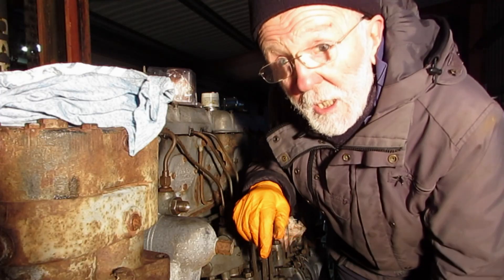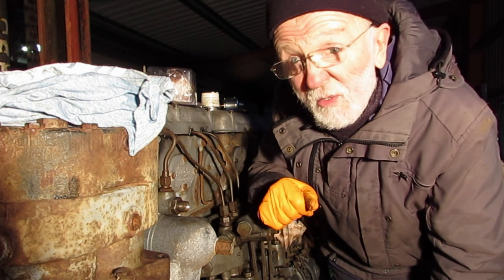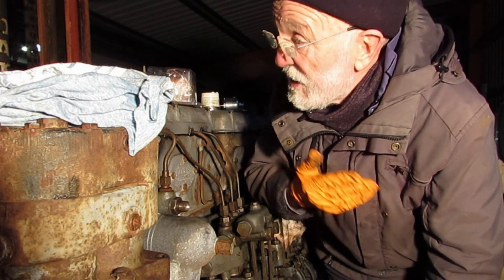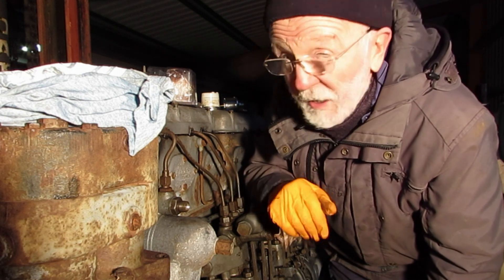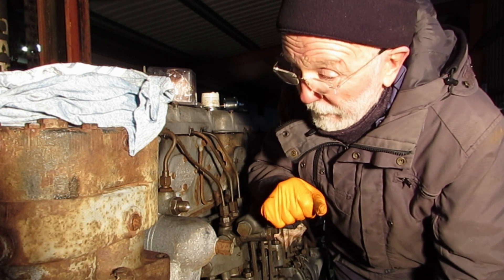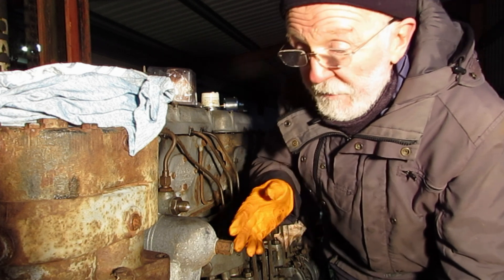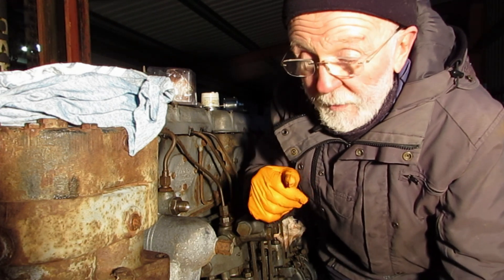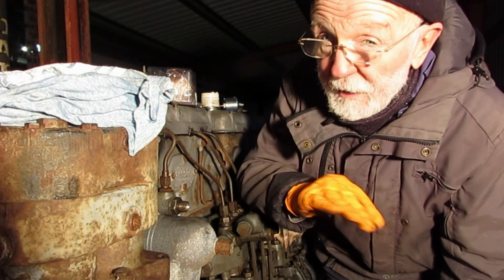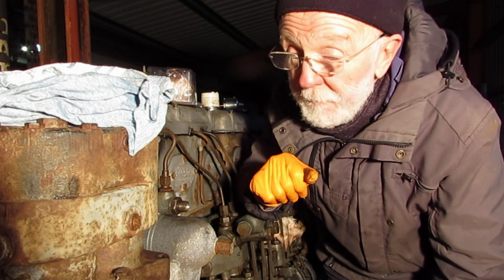So that's it. I don't have a lot more for you on measuring oil pressure because there's nothing to it really — it's very, very simple. My preferred method is the hydraulic method using an aneroid instrument and simple copper pipe. I hope you found that useful and feel free to ask whatever questions you want. We'll go on now and look at measuring RPM — we've already done temperature in a different video, so we'll do RPM next and then perhaps one on general instrumentation. Thanks a lot.